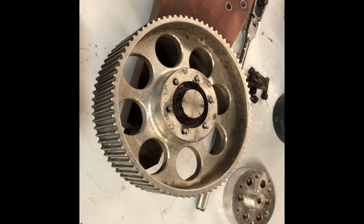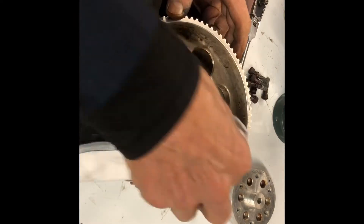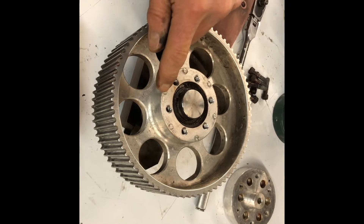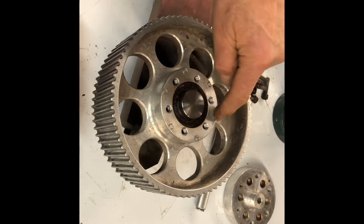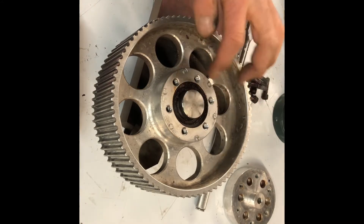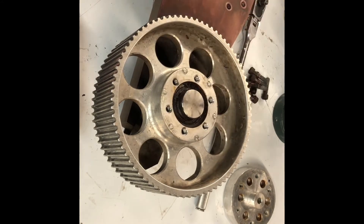What I do see — I'll wipe this off — check it out. Those are the marks from the bolts that hold the propeller on. We'll need to check that when we put it back together to make sure the bolts aren't too long, or maybe they're missing washers. Maybe the prop wasn't even really tight, because the bolts definitely bottomed out and that shouldn't be like that.